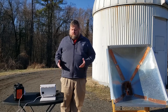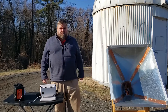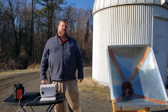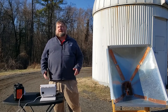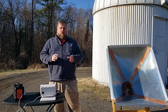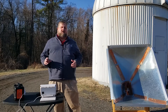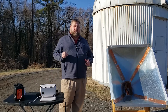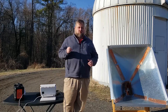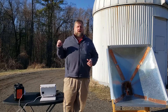Before you take a reading when you first set up the telescope, you need to calibrate it. The air is full of radio waves at all frequencies and that forms a type of background noise. We want to make sure we get a level reading of that background noise so that we can subtract it from our signal when we're trying to read the hydrogen line, allowing us to pick out the hydrogen line signal from any other signal.